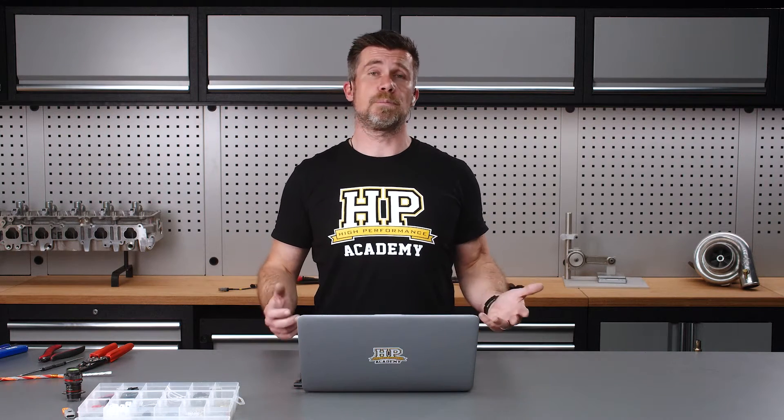A lot of this comes down to the soldering technique and specifically how thick the soldered joint is. If you've got a good connection between the parent conductors underneath and your solder technique is good, the effect on the overall resistance compared to a solid piece of uninterrupted conductor is almost negligible — so it shouldn't be a big consideration if your technique is good.